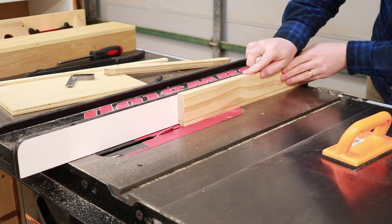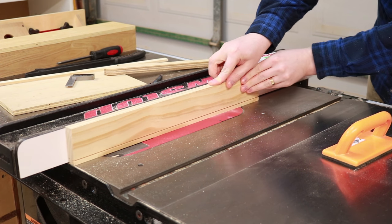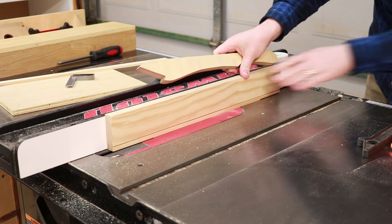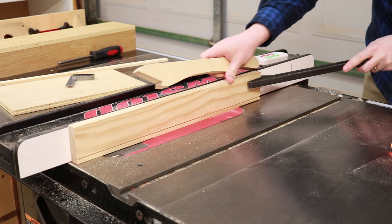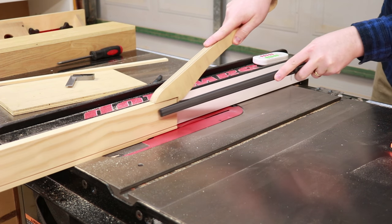It was a little bit taller so that the box would have somewhere to positively lock against. I didn't go all the way through the cuts, which meant I just needed to snap off the rabbet part and plane and clean it all up.